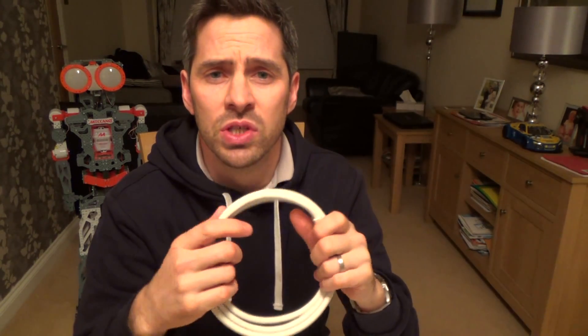It really depends on the cables you get. Some cheaper cables might be using aluminium rather than copper, but because they're digital, if they work they'll work just as well as an expensive cable. You don't have to spend £40 on cables, but for longer lengths cable quality does matter. If you get a cheaper cable, try it — if it works it'll work as well as an expensive one, because it's either going to work or it's not. Before running any cables around your house, just test everything on a bench first — lay it across the floor and see if it works.